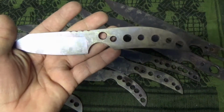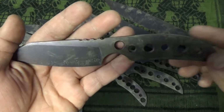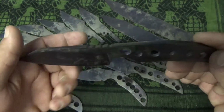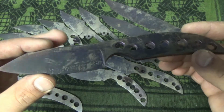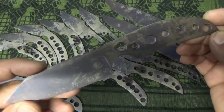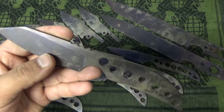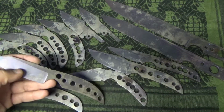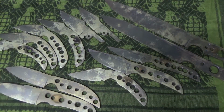So, it's about a 4-inch blade. I would go online to find somebody that makes something out of D2 in a 4-inch blade. Let's say maybe it's Benchmade or Spyderco or whoever makes D2. Find out what they ran it at, if it's 59-60, 60-61, or you could even call Peters and ask them what hardness they recommend. Okay? Like I said, I went for 59-60. It seemed to be a nice happy middle ground between edge retention and I guess flexibility.